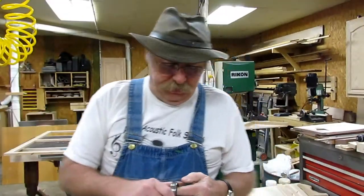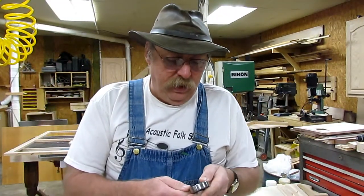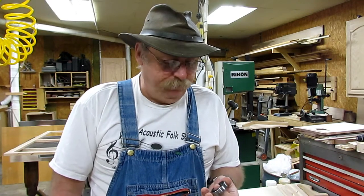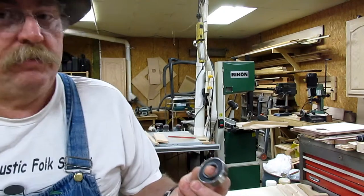This is a little video I'm going to shoot here today, explaining what's going on. I was working yesterday on the fish aquarium cabinet using my shaper, and as I was using it, it started vibrating and making a lot of noise. I thought I had a bearing going bad in the spindle, so I tore it down and pulled it apart, and sure enough I had some bad bearings.